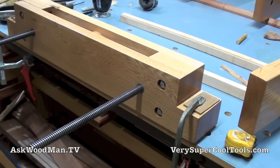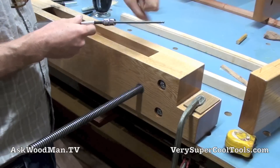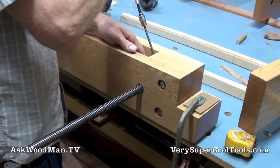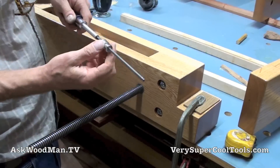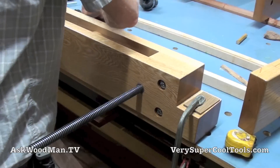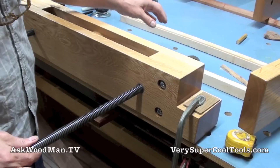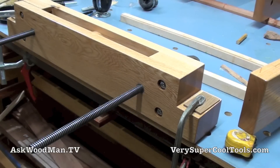This does not have to be — you do not have to put a death grip on any of this. It just has to be snugged down. The collar just needs to be snugged down nicely. I recommend you get a ball driver this size, or a T-handle ball driver. I use socket extension ball drivers with an adapter that goes into my hex drive. You've got an adjustable wrench, and like I said, you don't need to crank this down. Just one slight snug turn is all it needs — all you're asking it to do is not spin when you spin your handles on.